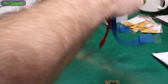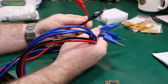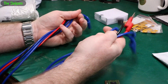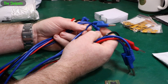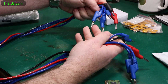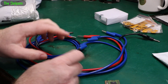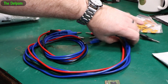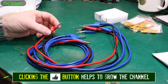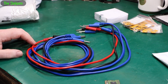Some more cables — a set of five, one meter long: one red, one black, and three blues. I was hoping for two sets of red and black, but it didn't specify, just an assortment. These are quite thick, heavy duty ones. I showed these before, did testing on them and they actually did quite well — quite low internal resistance. These are just a reorder with a different length; I've got two meters and 50 centimetres before. Thicker conductor means less voltage drop, so when you're doing load testing and voltage monitoring you want to make sure the load isn't dropping too much through the cables unnecessarily.